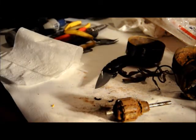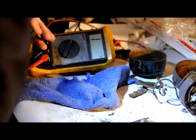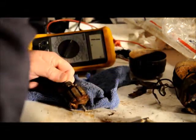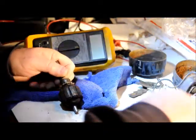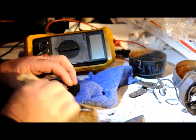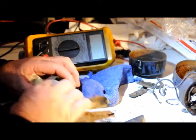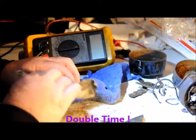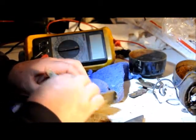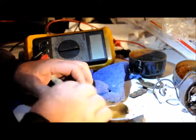Let me grab my multitester and I'll show you how we test these fields. I couldn't get any readings - I think there's maybe junk in between here, so I'm going to have to spray it with some electronics cleaner and clean off these plates with a little 220 sandpaper, being careful to stay away from any wires. I'm not getting any readings on the resistance on those commutator plates. In this case it may not be a good motor.